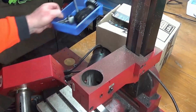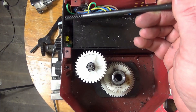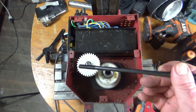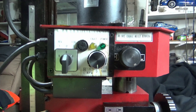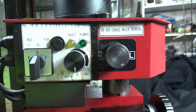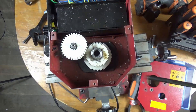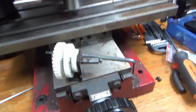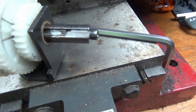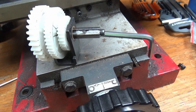It's all about the rigidity, and unfortunately this thing just doesn't have any. The fit and finish on this is something to behold, and not in a good way — it is absolutely fucking horrendous. These three gears here are the speed selector; it's supposed to be high and low, although it has never really wanted to work since I bought the machine. It certainly didn't take long to figure out why — these cogs slide up and down this shaft on a keyway, and have a look how they've milled this thing. It's obviously been made out of shit material. In fact, it looks like they've used another one of these machines to put the keyway in this shaft.